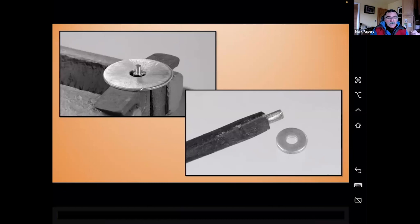Pull it out, let the wood cool down, quench it in your slack tub, let this cool down, drive this through, and the wood should be soft enough. Slip the washer on and then head over the rivet, and that's going to give you an attachment to wood. And then enjoy. And it's really good for setting those staples.